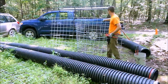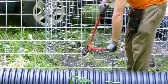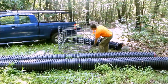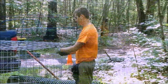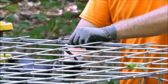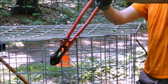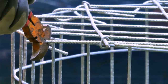To create a top and bottom for the intake fence structure, cut two 5 foot square panels if you are using 10 or 12 inch diameter pipe, or two 6 foot square panels for a 15 inch pipe. Tack the first panel, which will act as the top, to the cylindrical intake fence with a hog ring at the 3, 6, 9 and 12 o'clock positions. Using your bolt cutters, cut off the top fence corners leaving only prongs extending past the cylinder wall. Bend the prongs with fence pliers to further secure the top panel to the cylinder.